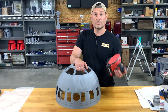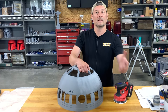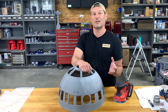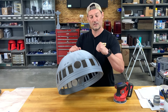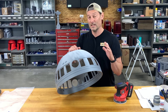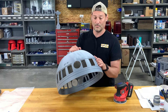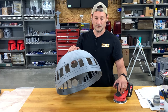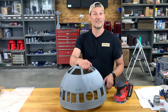As you can see, I'm not bearing down with this. I am being very light with the 80-grit. I just want to scratch it — we're not trying to remove print lines yet, just scratching off the high spots. It's very important when working with 80-grit: the longer you stay on a piece, the more it's going to melt that section. You can start separating shells and filleting back some melted plastic. So be careful not to do that. I'm going to finish the dome with the 80-grit and then move to the next step.